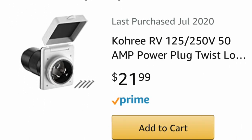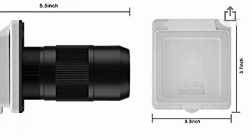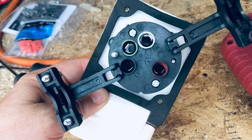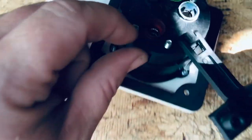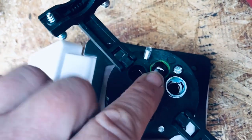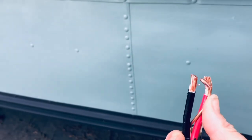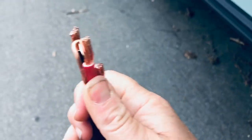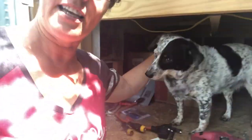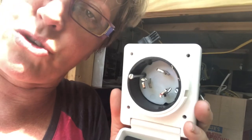Here is the actual plug that I totally fell in love with and ended up putting on the bus for our 50-amp shore power. Red is hot, black is hot, green is ground, white is neutral — we've got green or ground, which is just your plain copper wire. You've got black — that's hot. You've got red — that's hot. You've got your white, which is neutral. This is a twist lock — a 50-amp twist lock. This is 6-3 or 6-4 wiring, that's what they call it. There's four wires in there; they usually don't count the ground, so it's a 6-3.